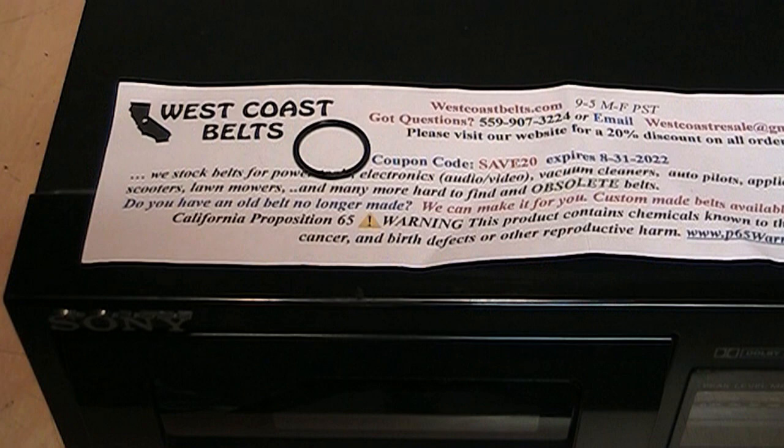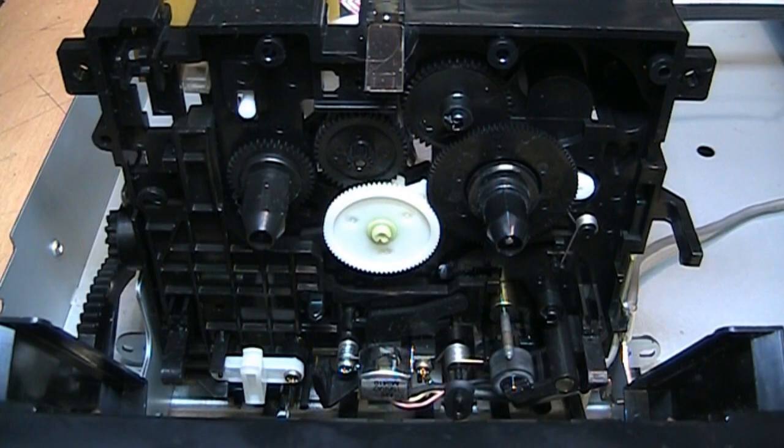And I also verified with him the proper sizes of all the belts in this deck. So from now on, anyone who orders the belt kit for it from them should not have the same problem that I did. While I still have this thing apart, I took the opportunity to clean the heads and capstans